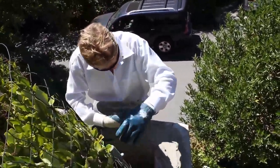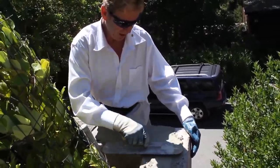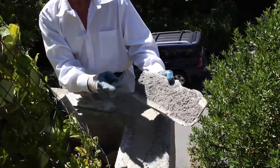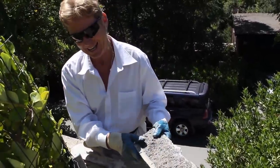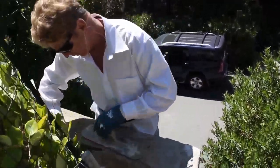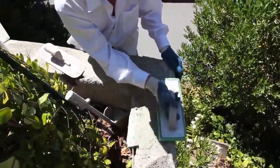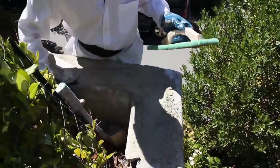The finish we put on here before is simply cosmetic. What we're doing is pushing cement into this large crack. I opened it because I was curious and found that this is cinder block — it pushed away just enough that the cinder block exploded. I've seen this about 20 times; cinder block can explode with enough movement. This piece came from here. So we put it back together and then take a float and just float it right in there, giving it the same texture as a few years back.